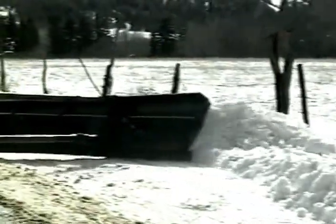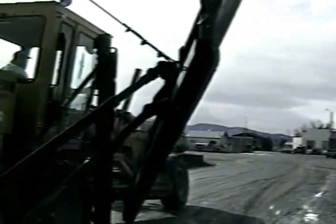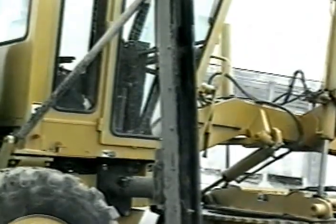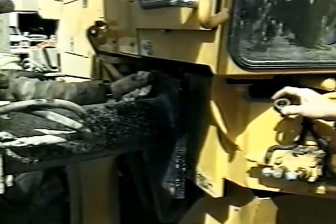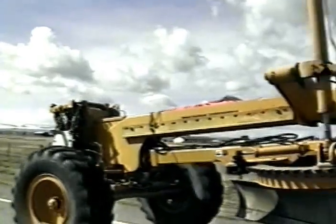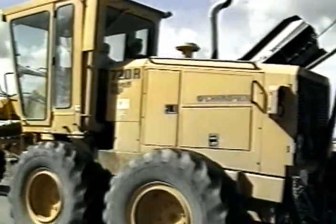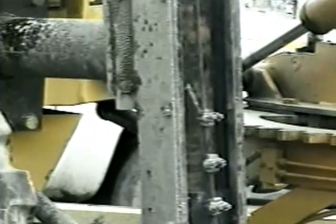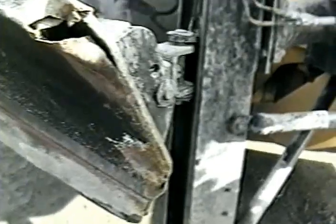The wing plow is perhaps the most complicated of all plow types. It requires the connection of front and rear most interfaces to the telescoping hydraulic arms attached to the plow. This film will illustrate the use of a common wing plow interface used today. It is assumed that the proper interface is already in place on your motor grader and your task is limited to attaching the mold board. The front mast is used to connect the inside or toe of the wing to the motor grader.